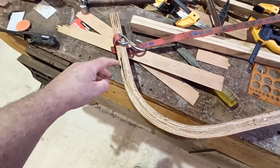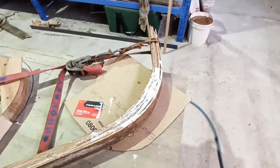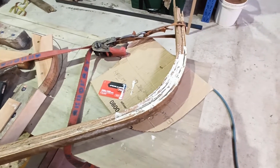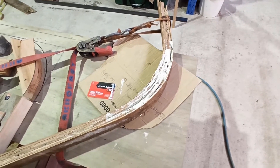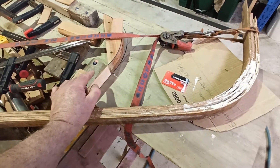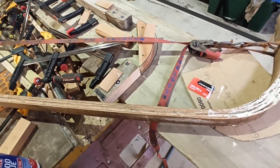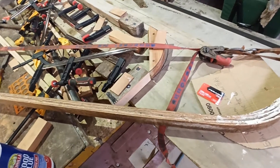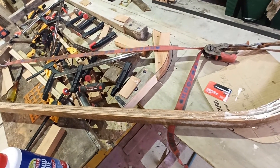I'll let it cure up and then we can try to clean it up later. I'll leave it for a couple of days in the corner to set. I'll possibly have to extend the form up higher for the big wide one because it's 75mm wide — I don't want to be squeezing everything in and then have it spreading out at the top. We'll see if we need to add some extra wood at the top of the form since it's deeper. It might pull fine around there, but I don't want to risk it going wrong.